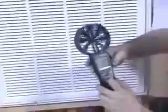Now on the main measurement screen, make sure there's no nomenclature that says min, max, or hold. This vane is a very precise instrument and it's actually detecting the airflow from the grill already. What we're going to do is enter a mean timed average mode. I'll press the mean key two times and that's going to bring up a timer. Even though the instrument is making a measurement, it's not recording that measurement yet — you can see the timer is off.